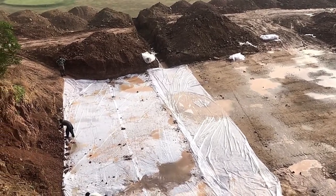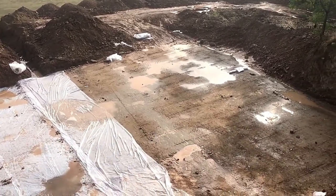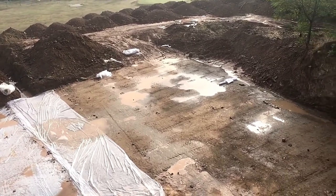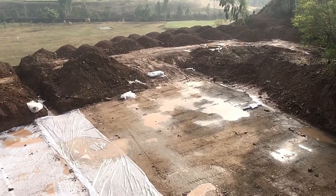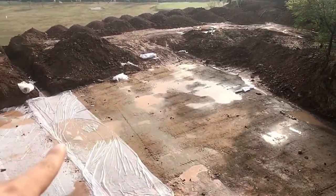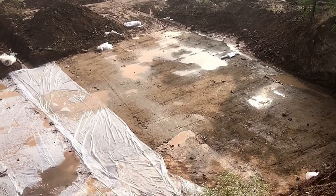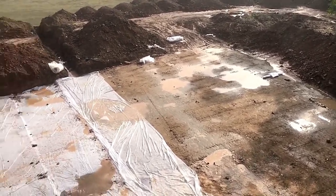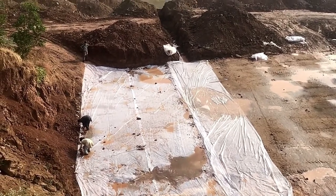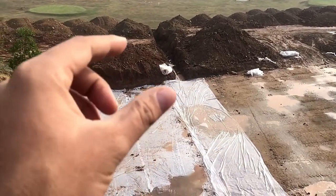We thought there was a forecast of rain affecting our foundations. This is the subgrade of this building, and we were planning to execute the foundation works here, but unfortunately rain was foreseen. This area was very well compacted and FDT had been conducted over this area, but we couldn't execute our foundation works because of the upcoming rain. We wanted the surface to be saved from rain.